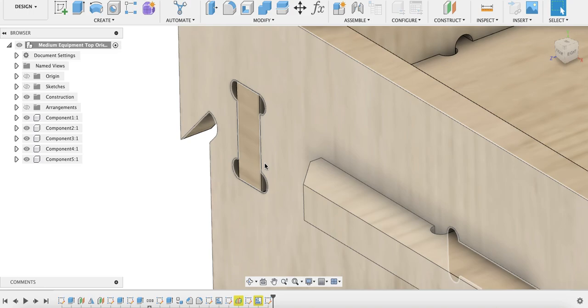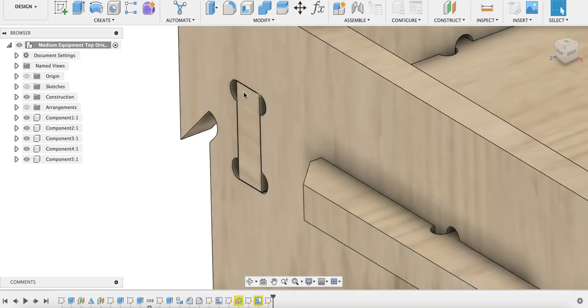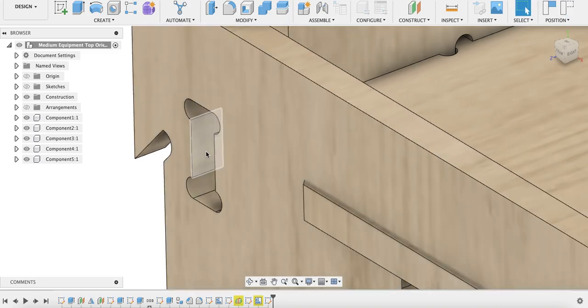you'll actually want to download the 0.495 inch material thickness. Now, even if you don't get the perfect fit, you do have options. For example, if I find my fit to be too tight, which was usually the case more than being too loose for me, then I run a rotary tool, something like a Dremel, around the perimeter of the friction fit components inside this hole. I slowly run the Dremel inside there and slowly remove material, checking the fit as you go.